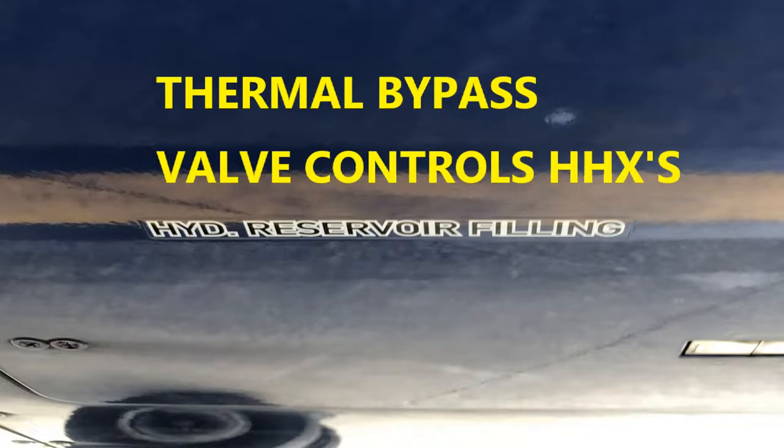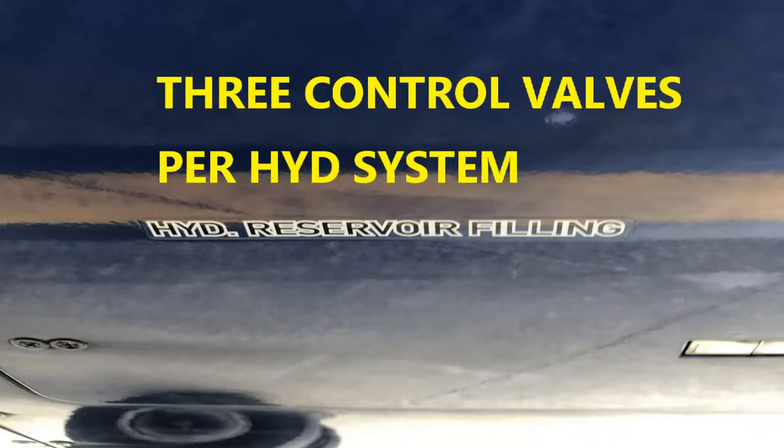There are also temperature control valves — three for each hydraulic system, green and yellow. These are located at the wingtips, upstream of the most remote actuator, specifically the outer aileron, and one is in the trimmable horizontal stabilizer compartment. The temperature control valves are temperature and differential pressure controlled. They supply a metered flow from high pressure to low pressure if necessary, converting hydraulic power to thermal power to increase temperature and ensure the fluid is not too cold.